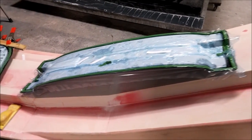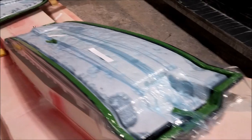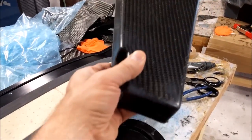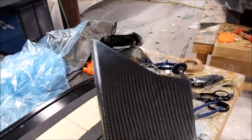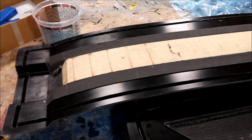The next day, the second roof brace is completed — already bagged, cured, and the vacuum removed. Then there's the little brace for the rear pressure bulkhead, between that and the aft bulkhead. It's finished and popped out of the mold, mostly trimmed on the back side already. That thing barely weighs anything because it just has the lightweight one-inch core in it — it's feather light.